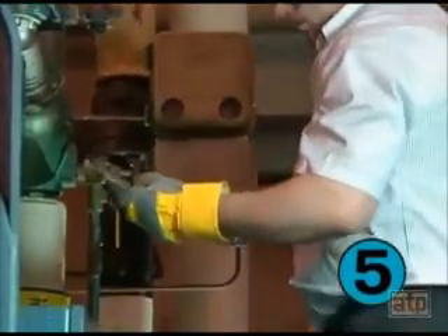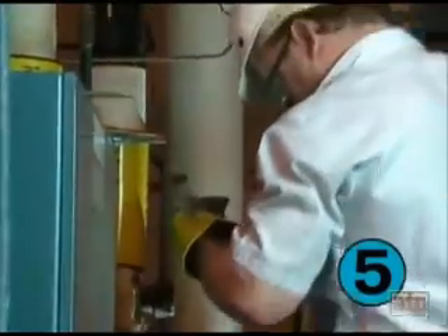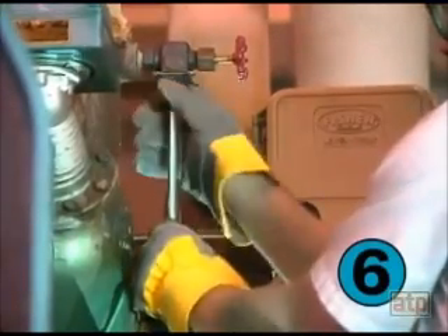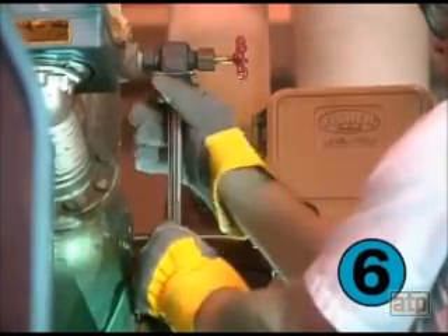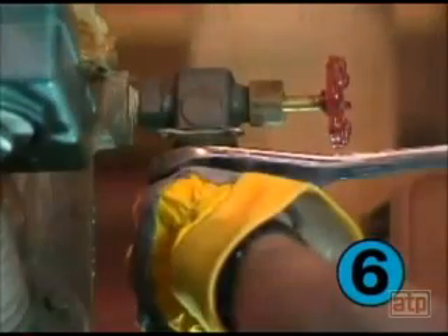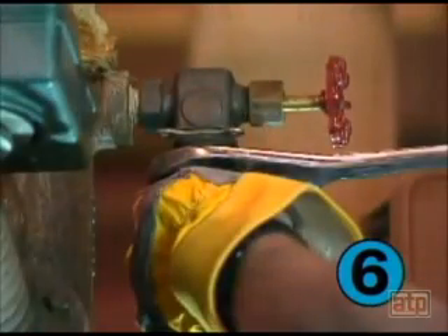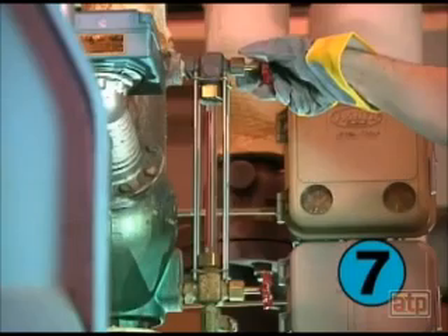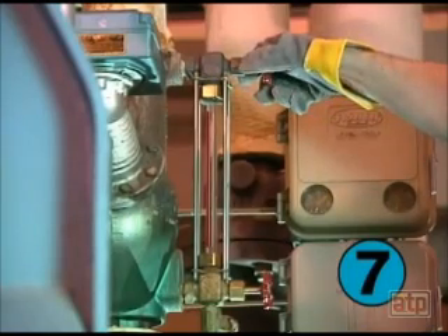As a safety precaution, wear gloves and eye protection. 6. Install the new gauge glass and new washers. If the glass must be cut to fit, allow one-quarter inch under the inside measurement for expansion caused by heat. 7. Hand tighten the gauge glass nuts and then give them each a quarter turn with a wrench. Then slightly open the steam valve to the gauge glass to allow the gauge glass to warm slowly.